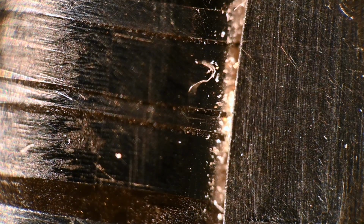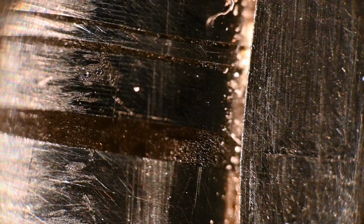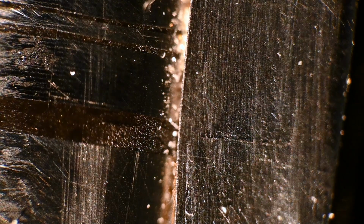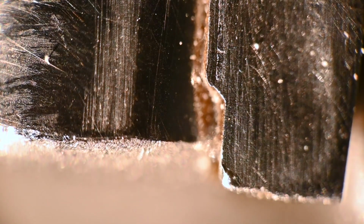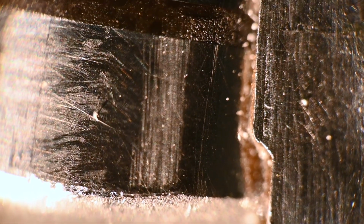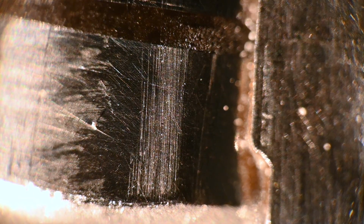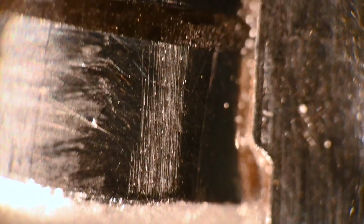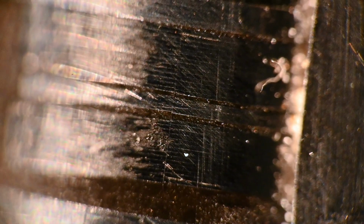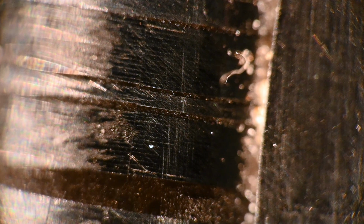So again, is it in the tape path? I don't know, but it's not acceptable to me. And right there, it's perfectly obvious that that was a scratch mark because it didn't scratch the potting compound. Or it did, but it's not visible. It did the metal worse. It's a very soft metal. So I don't like this. There's a lot about this lapping job that I don't like.